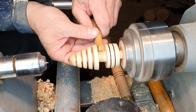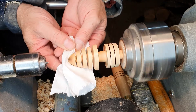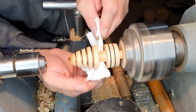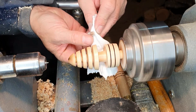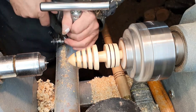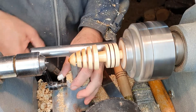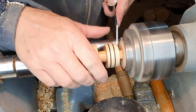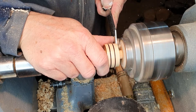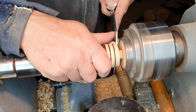You can use wood wax 22 or the micro crystalline paste wax, but this is nice because you can buff it off immediately. The micro crystalline has a higher melting point, so it means that you don't get any finger marks on your nice bit of timber. When you undercut the base, you just need to do a slight undercut when you part off, so that if you decide to stand it up and not hang it from a tree, it will always stand flat.